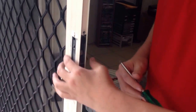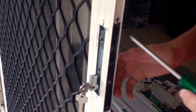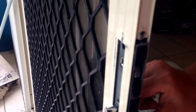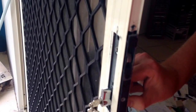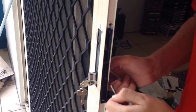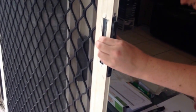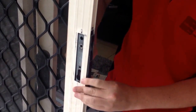So this is the most difficult part of the job — taking the cylinder out of the lock. Now what people don't realize is that there's a little trick to it. You need to insert your screwdriver in here, push in, and that will trigger this latch here. Then when you want to lock it, turn it all the way to the side. Undo this one cylinder screw — this is the screw that actually holds the cylinder in. Undo that, and there you go, there's the cylinder.